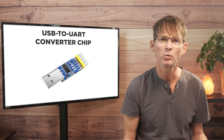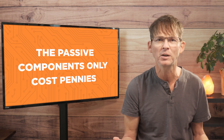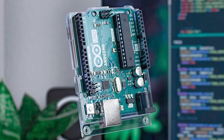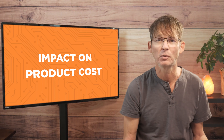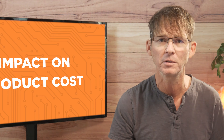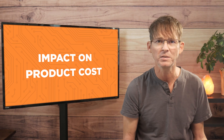This just leaves a few really low cost components such as a linear regulator, a crystal for the microcontroller, and any connectors. The passive components like resistors and capacitors only cost pennies. If you were going to replicate an Arduino exactly, you would also have the cost of the PCB itself and the cost of soldering on the components. However, since you're already likely to require a custom PCB for other parts of your circuit, this cost will be absorbed into the cost of your custom PCB. Regardless of the development kit, they will always be considerably more expensive than designing your own custom PCB solution.